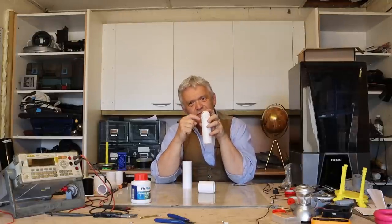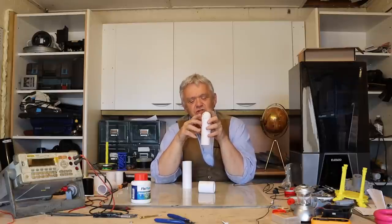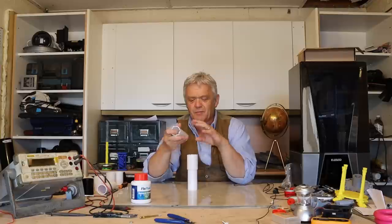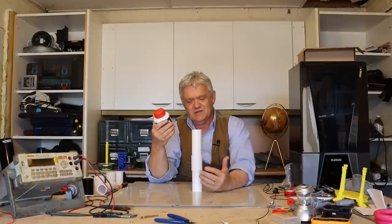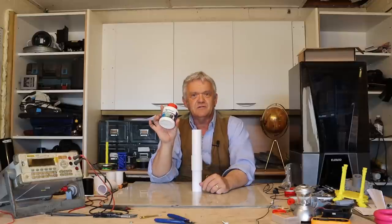When the ball sits in there, there's still a path for fluid to flow — the water can get around the holes we just created, but the pipe still acts as a stop for the ball. So we've got our o-ring in there, we pop the ball in, and pop that piece in — the valve is pretty much done. The only thing left is to glue it together.